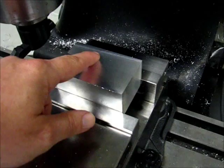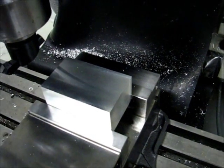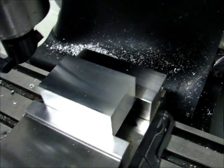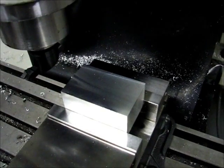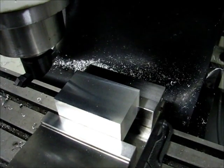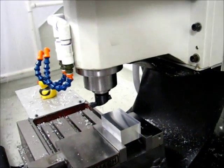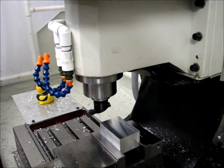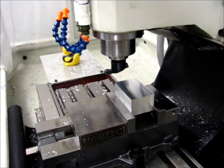With that quarter turn on the bolt, it does appear that the trailing cutter marks are a little bit more defined. I'm going to rotate it another 90 degrees and see that goes further away from the target. So that's what I'll do next. So I've rotated the bolt another 90 degrees. So that's half a revolution total. And let's run and see what happens.